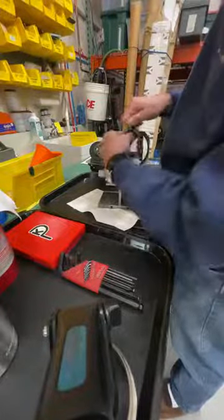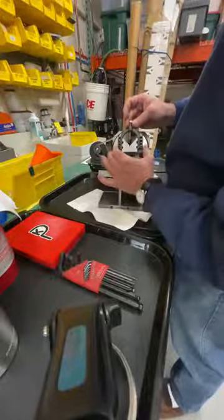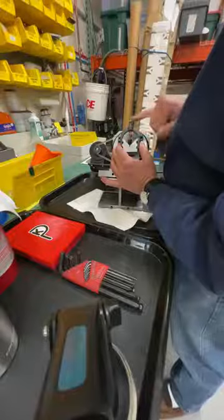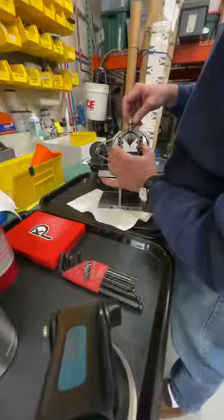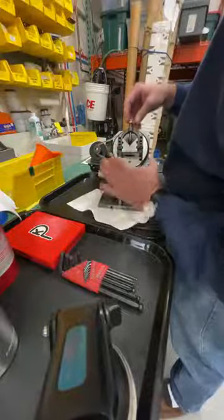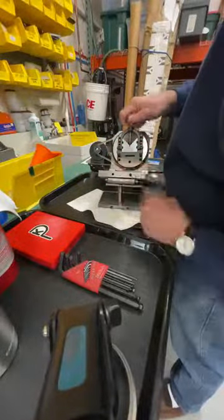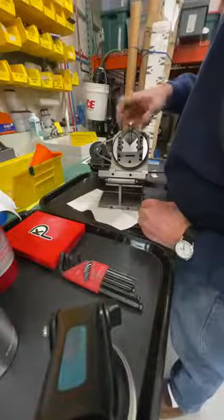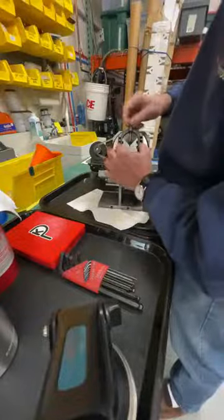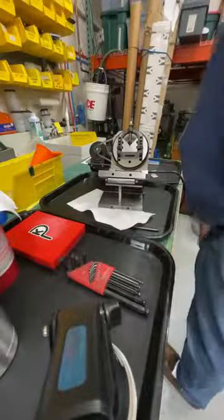All right, so the other thing I did is I've replaced, this is the clamp for the V-block, and I've replaced the screw with a very long stainless steel screw. This is quarter 20. Sorry for our European friends. But this guy will go all the way down to the bottom, and then they could tighten it up with this nut. So that's how we're setting that. I'm going to go grab the D-bit itself. I'll be right back.